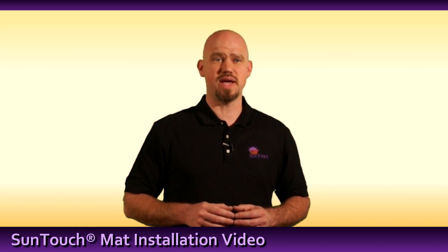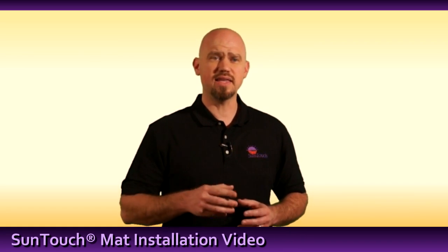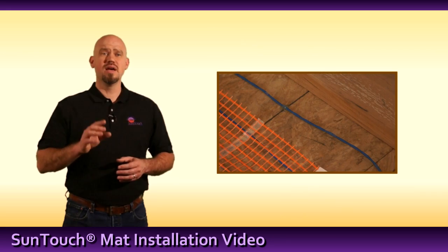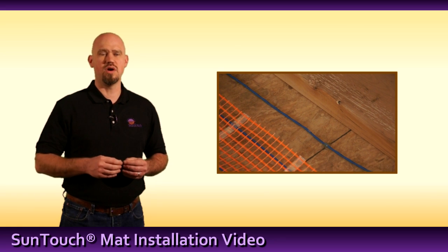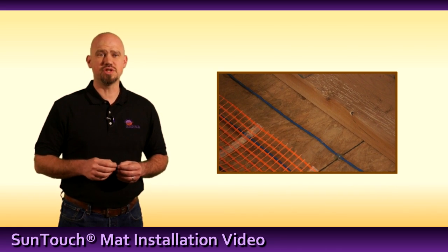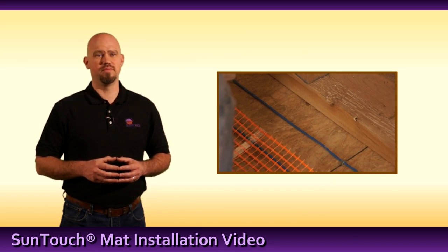Do not cut the mat if there is too much to fit the area. Find an area to use the excess. Mat can be routed around the perimeter of the 4 to 6 inch gap along the walls, staying at least 2 inches away from other installed mats, built-ins, and the wall.